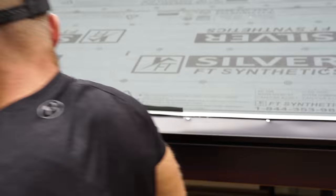And this process is one of the main contributing factors to having that leak-proof, fastener-free roof, because a lot of times on this detail, even when we do it because we're doing an exposed fastener, this trim is going over top of our ribbed roof, and then we're just screwing right down into ribs. Now that's good, the washer on that screw should last and it should do its job, but this is a nice guarantee because all of our fasteners will be up underneath the flashing and not allowing anywhere for water to get at them and do work over time.